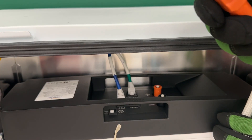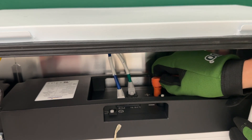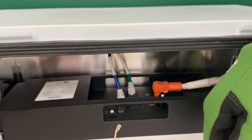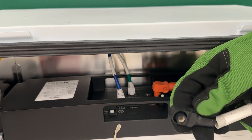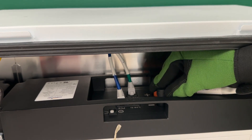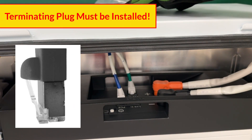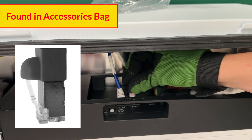Installing the battery cables is easy. Match the cable label to the battery terminal label and plug in until you hear a click. Begin with the communication cables and then the power cables. It may be easier to snap the power cables onto the battery module posts by pressing the small button on the side of the plastic connector. It is very important that the terminating plug is installed into the link in terminal on battery number one.